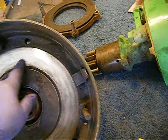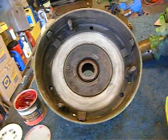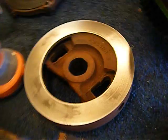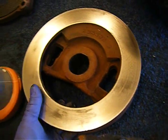We've cleaned this up. I've sanded this surface to knock the junk off of it, and I'm not going to have it machined because it worked to begin with. I've just used my orbital sander and a 150 disc, sanded it to knock the junk off, both sides.